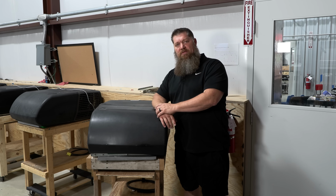The simple coil cleaner for you to get, and it doesn't matter which big box store, wherever you're at, you want to get the coil cleaner that has the soft bristle brush up top. I can use this to help get a lot of that dirt off. Now, the coil cleaner itself can get some of that dirt off, but if I just simply spray that on there, there's no way the foam is actually going to get that off. So I need to carefully take that off.